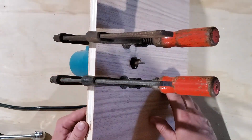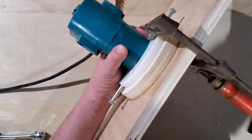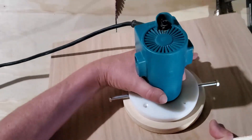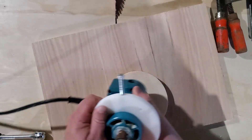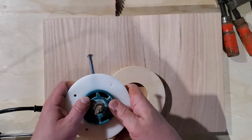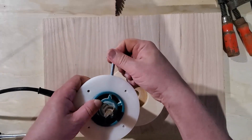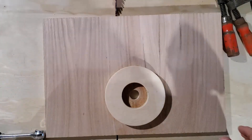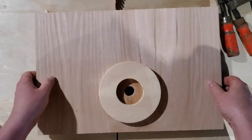Even though this seems to be slightly turned, that part doesn't matter because I haven't put the screws in to hold it in place yet. I put this in place, put a bit of glue there, and then from underneath I can make sure that the router bit is centered perfectly, then just clamp it all in place and wait for the glue to dry. That's as simple as that — it was actually rather easy to do. After taking the clamps off and building the legs — I decided I was going to make this a little bit more elaborate, but I want to test it out first in case I want to change anything before doing any fine woodworking. So what you're going to get today is mostly just a functional item.